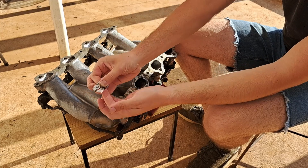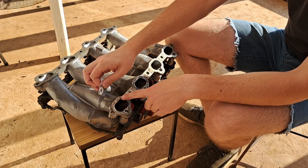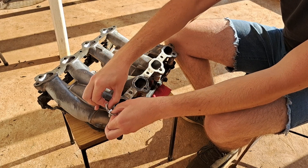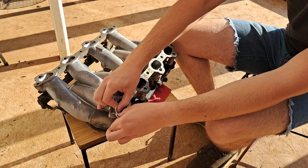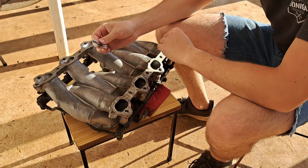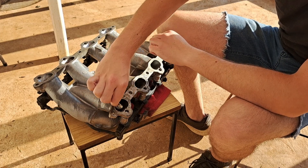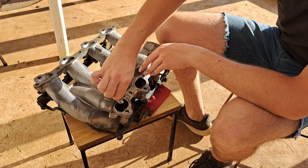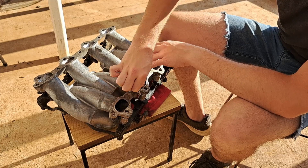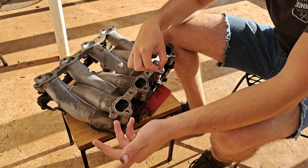Take extra care not to dig into the aluminium, because this steel, even though it is paper thin, is much harder than the aluminium so it will dig in and ruin your surface. You start by doing that just to remove the very worst of the RTV that is stuck on the surface. Once you are done scraping off the worst of it, you want to take your blade and hold it at a 90 degree angle compared to your surface and just scrape at it. There is really no nuance or technique to it — you pinch it, hold it and scrape it. Obviously try not to dig into the aluminium because you don't want to leave any scoring marks.